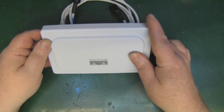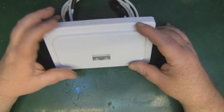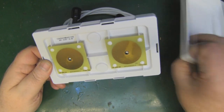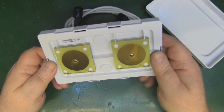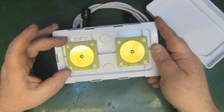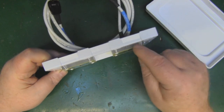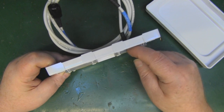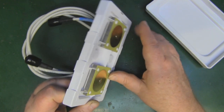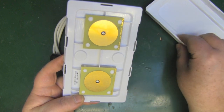Let's crack it open and see what's going on. I think we're just going to have two panel antennas with just one element each, but you never know until you open it up. It's very simple - no screws, just some clips on the side. I'm really surprised - we've got round elements in here and they are absolutely beautiful. We also seem to have some kind of perspex dielectric in between the driven element and the back reflector.